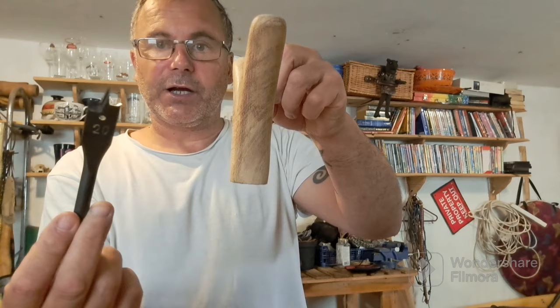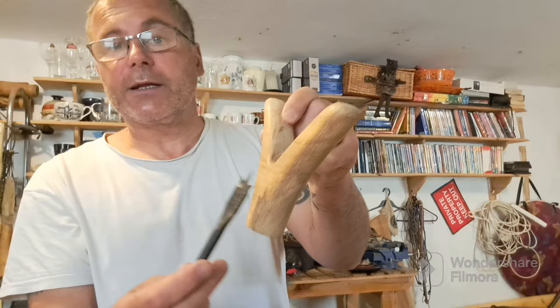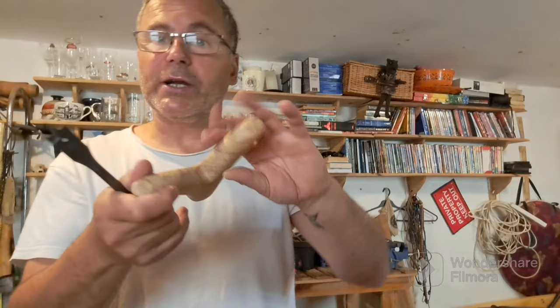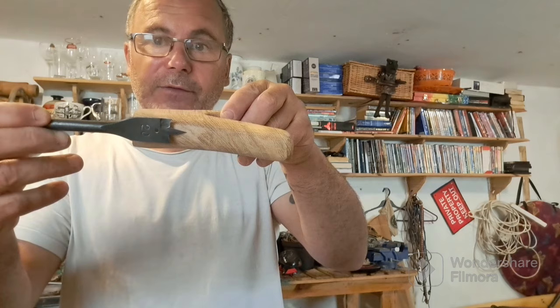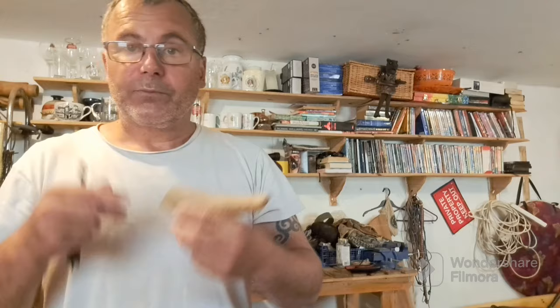My concern was to make sure I've always got enough I can drill out and still not destroy the walls of the hole, as in coming through the actual Y piece. So trying to keep it intact. And I've just had a look, and yes, I do believe that if you have a look there, I've got enough there. I can go up through, leaving enough meat on those walls to be a real sturdy fixing on top of the shank.